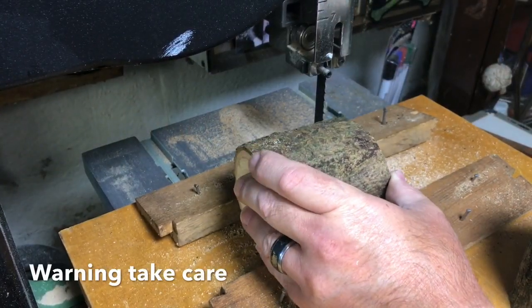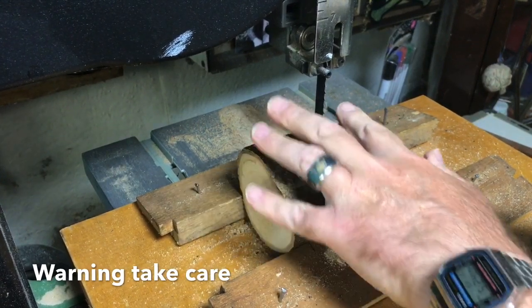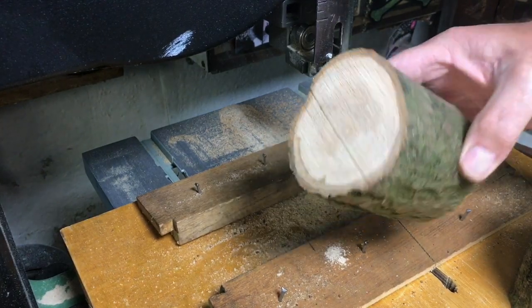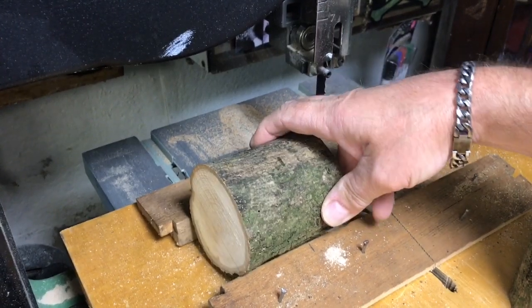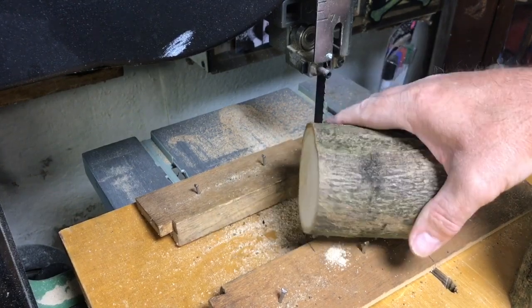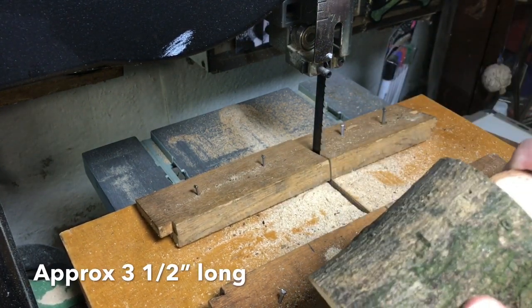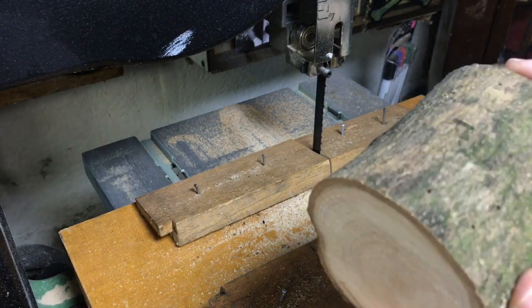While I was cutting these, one of them did grab and jammed up the bandsaw. That's the reason why you have these pieces supporting, but what happened was I got on a narrow piece of the log and they weren't holding it enough because it was resting on the bottom. So you just have to be wary about that. The bandsaw does try and grab the side and pull it down, especially with this blade — this is a really coarse blade. I've got three done and I'm cutting off half an inch for the back of the bandsaw box.